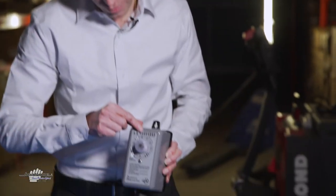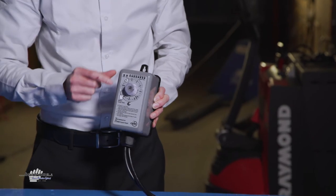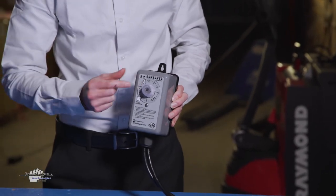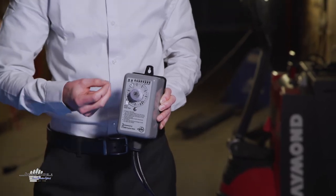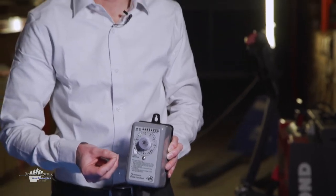As an example, if we actually programmed it so that it was on a 30 minute interval with the dial set for 50%, we are still duty cycling 50% but now the system is going to run for 15 minutes and then remain off for 15 minutes, and then it will start the sequence again.